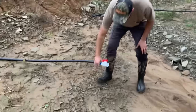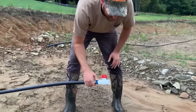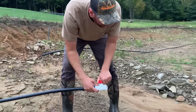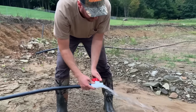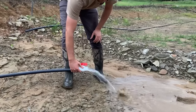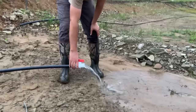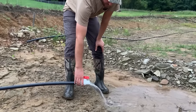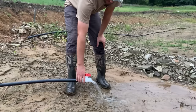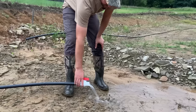This is going to be the moment of truth. I know we're going to get some water coming out because the line has water in it. I'm just hoping it has enough to continuously pull water from the creek and we're not just draining all the water we just primed. We'll let that run for a minute and see if it's able to pull water from the creek. It seems like it's losing pressure — we might not have a good charge. Might be that spring valve too, I don't know.